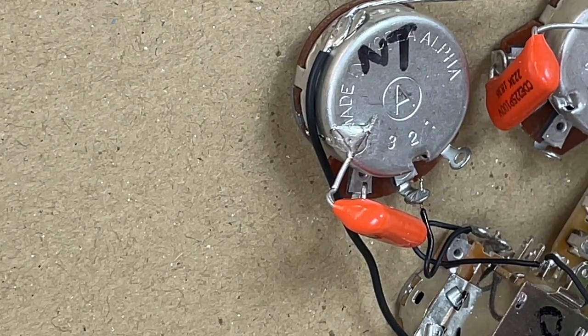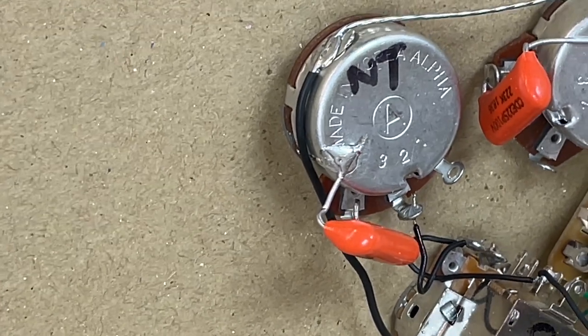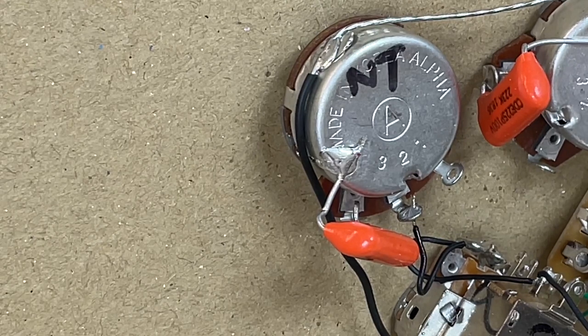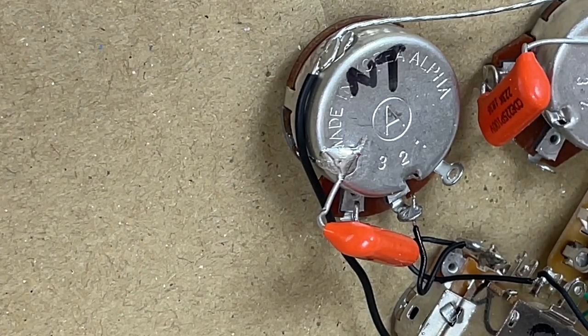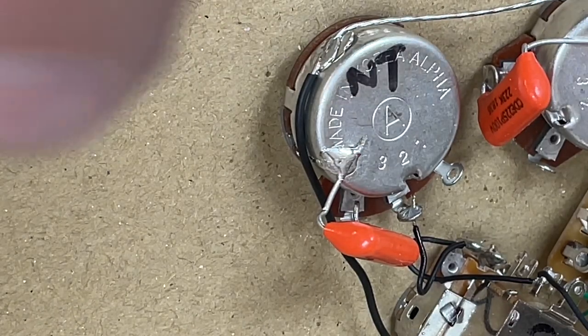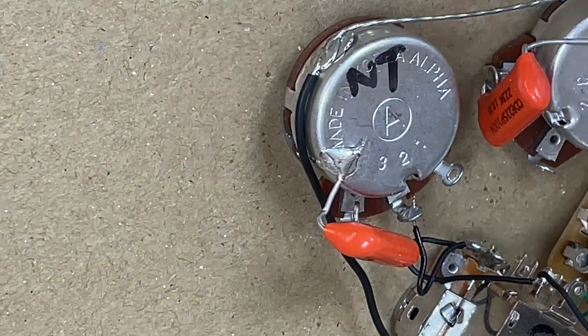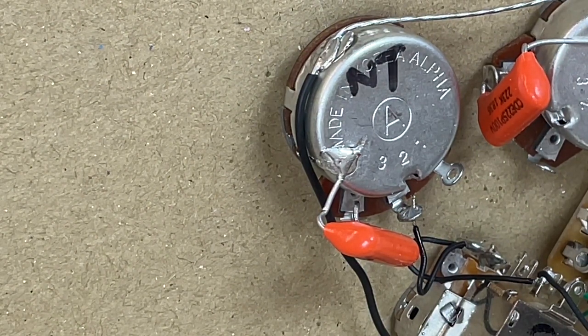So there's not a lot of complicated things, but the white hangs out to connect up to the existing white as it comes in from the pickups. Again, giving us the room to couple these up. The principle here being you can always push in, tuck in some wiring that will always fit in a cavity, but you can't get the hot soldering iron in there if it's not enough space. But there's always enough room to tuck in a bit of spare cable. Probably could have gone across there in a single jump, but let's take a piece of this and we'll go in and curl.